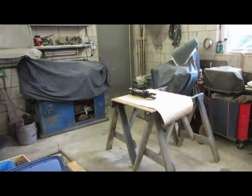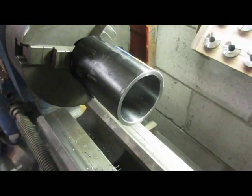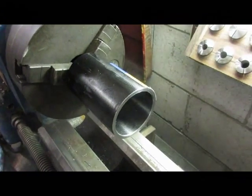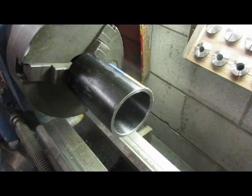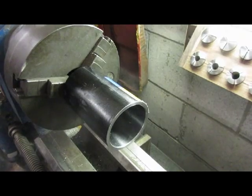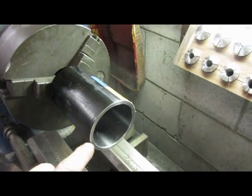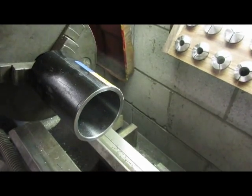We're going to take that aftermarket cylinder and cut it down. I've already cut it shorter — it doesn't need a lot of stroke, it's going to have about four and a half inches. I'll have to change one of the attachment points. I've just trued it up in the lathe and put a chamfer on here. I'll clean up the chips and give it a test fit.